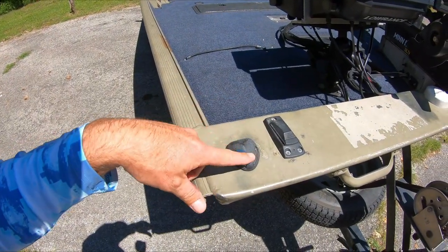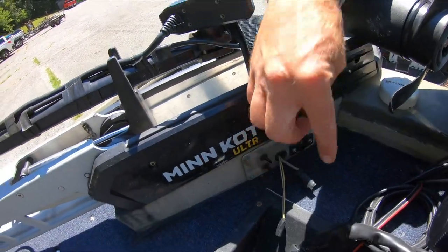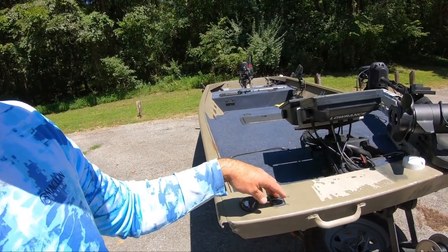I've got an LED nav front light run to a switch panel right here at the front. The front light and the rear light are both run to the front switch panel and the back switch panel, so if you're night fishing and hear a boat coming, you don't have to walk to the rear — you just flip the switch right by the trolling motor. I've also got another nav port hot-wired straight to the battery for a Yolo Tech power stick, so I can run a camera up front without worrying about power.